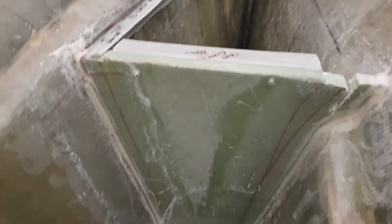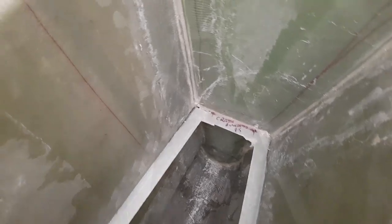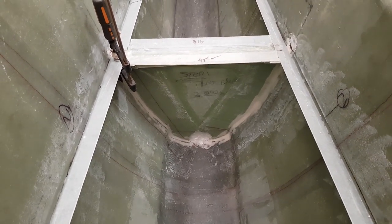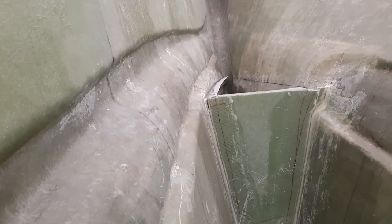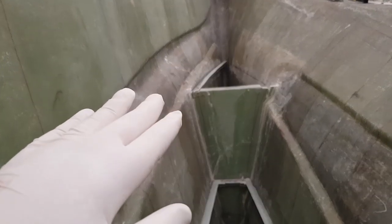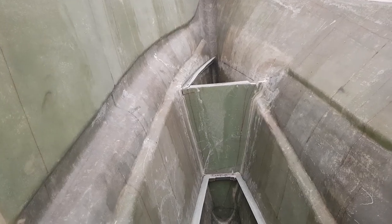As it is an airtight seal, I'm also considering putting a pipe down in the bottom here that runs down into the bilge through this limber hole, and there'll be a ball valve or a tap here so I can access any moisture that may build up inside that crash bulkhead. But yeah, that's actually worked really well. It's not dead level, but that's not going to matter because there's going to be a lot of filler underneath the crash bulkhead that's going to sit on there, and then it'll be bogged with the foam bedding compound and then radiused and then tabbed as well. So there's plenty of sealing going on there, and it's going to add a tremendous amount of structure right up into that bow.